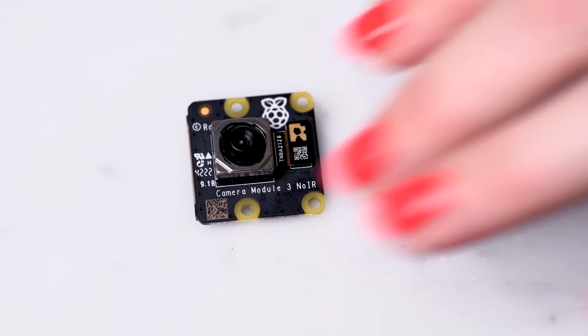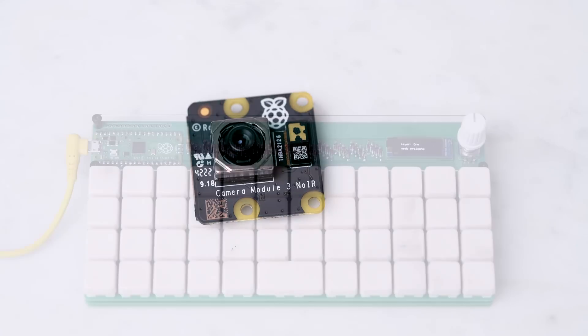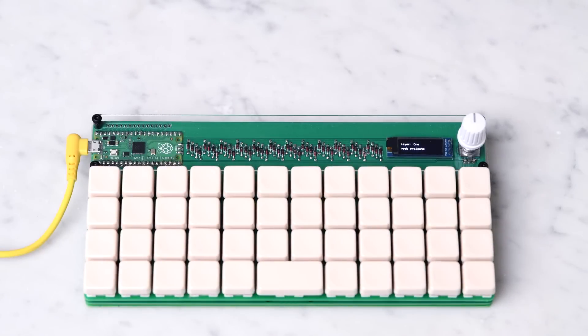The Raspberry Pi Foundation has released their Camera Module 3 range. Each of them has a 7.4mm, 12MP Sony sensor, an f1.8 lens, and focus adjustment from 10cm to infinity.